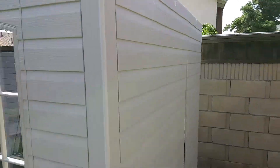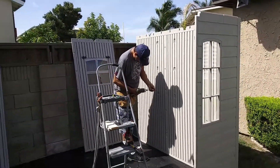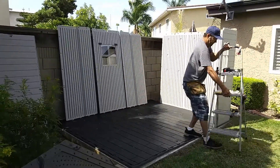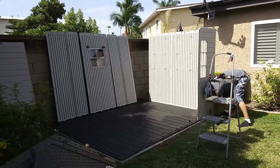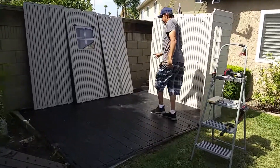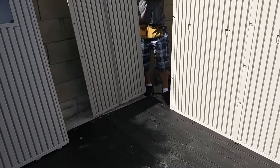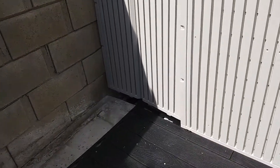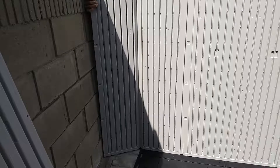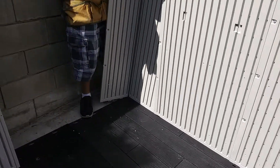These seem to be going perfectly. You get your first four wall panels set up. I'm pulling it away from the wall — this particular one you've got to have a little space to get that rear wall panel on. I slid it off of that foundation so I can get this wall panel on. It goes just like you see here — see the extra space you need. You can fold it a little bit, but it's got to drop in just like the other wall panels, drops into those two holes. Then kick it over to the right — you've got to have some space back there to get some leverage and move it over. Bump it to the right, as you can see right there, perfectly illustrated. You want to have an eighth to a quarter of an inch inward on that so that panel lines up nice and perfect. Swings the corner around, pull it down, and it went click click.